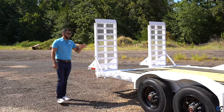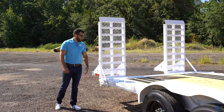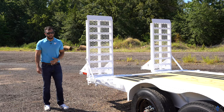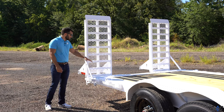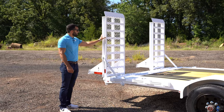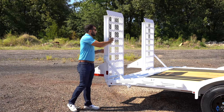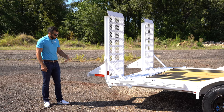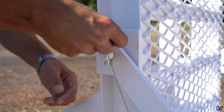Moving to the back, the LPX has several different loading options available: a straight deck with sliding ramps, a two-foot dove with sliding ramps, or a two-foot dove with 24-inch wide HD knee ramps — which is what this one has — and also a max ramps option. These ramps are spring-assisted, heavy-duty, four-inch channel construction with number six-grade expanded metal, and a reinforcement on the backside with two-inch square tubing backing up the two-inch square tube cleats. They're great for hauling skid steers, excavators, and all concentrated-weight equipment.